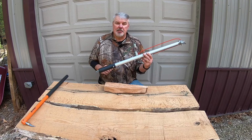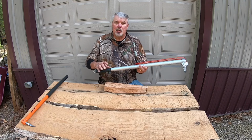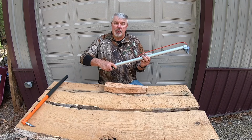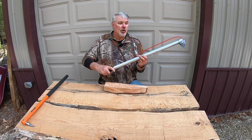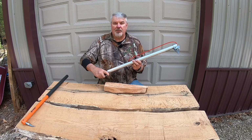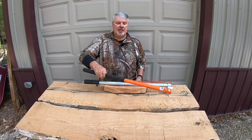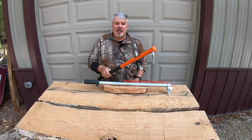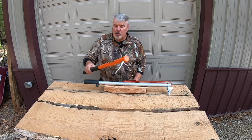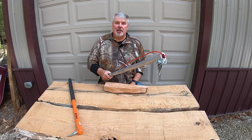This has a little pistol grip here, and that's for indexing. When you pick the tool up, you put your finger right on there. It does two things. One, gives you more grip to pull back with, and secondly, you know when you put your finger here that the tip is in line with your finger. Whereas if I take a standard one and I just pick it up like this, I have to reposition it to get it forward or parallel to my body here. Whereas with this one, I just pick it up, I know I'm ready to start picking logs up.